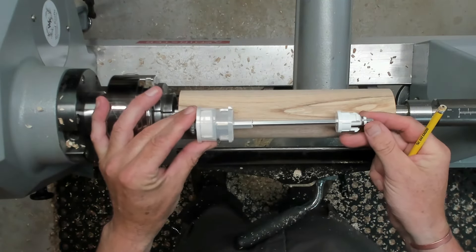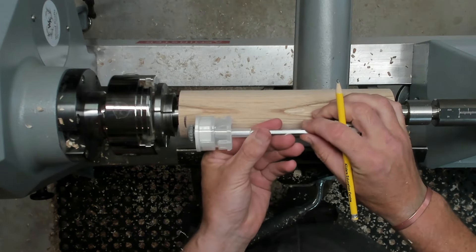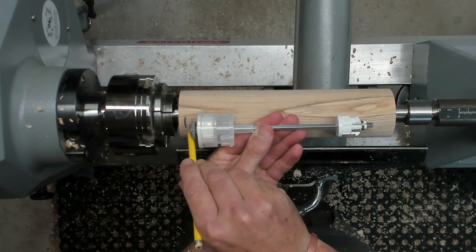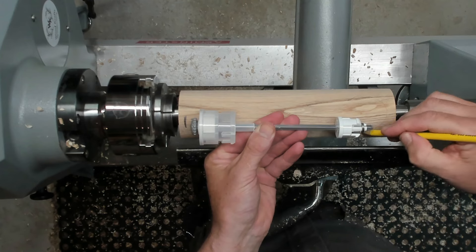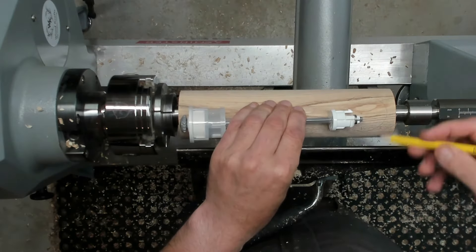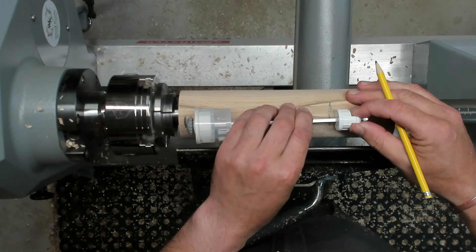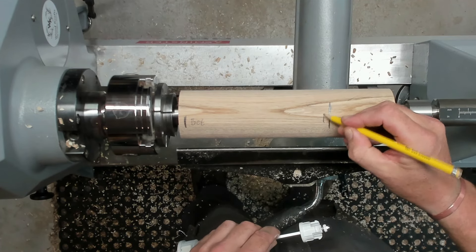This is the size of our mechanism, so I'll just get a few lines on here. First of all, I'm going to be putting a tenon here. I want the bottom of the crush grind here — so this is going to be the bottom. This section here is going to have a ball on it, so I'll be parting that off. That part of the mechanism will be up in the ball. I need to part it off here — I watched that video maybe a week ago, so I'm just winging it. I'll part it there, and I'll need a tenon on this end as well.